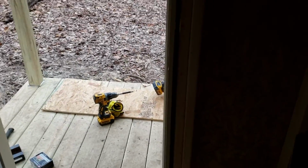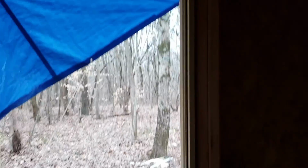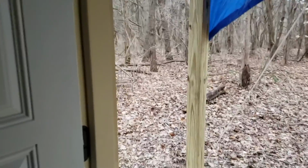It's going to be dark in here, you'll see. Basically just need to cut some shims, some wood to fill those gaps. Then we'll put some screws in, and whatever else doesn't get filled will get filled with foam. The main thing is, especially where the hinges are, you want one long screw. Take a screw out of the hinge, a couple of the middle ones out, and replace them with longer screws for security. And then the plate right here, where the hardware is going to be, obviously make sure that's fastened to these two 2x4s.